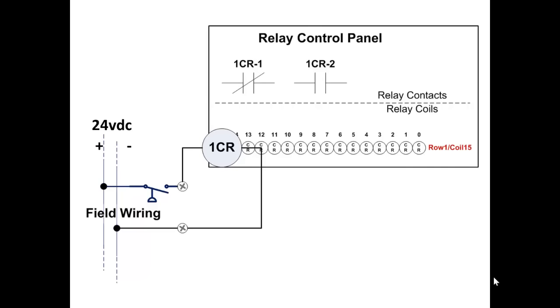These are all contact relay coils. We haven't changed to bits in memory yet. So if you look at our diagram here, this portrays a connection between an actual input device, the relay coil, and the relay contacts. Always remember that there is no electrical connection between the input device and the relay contacts that represent their state.